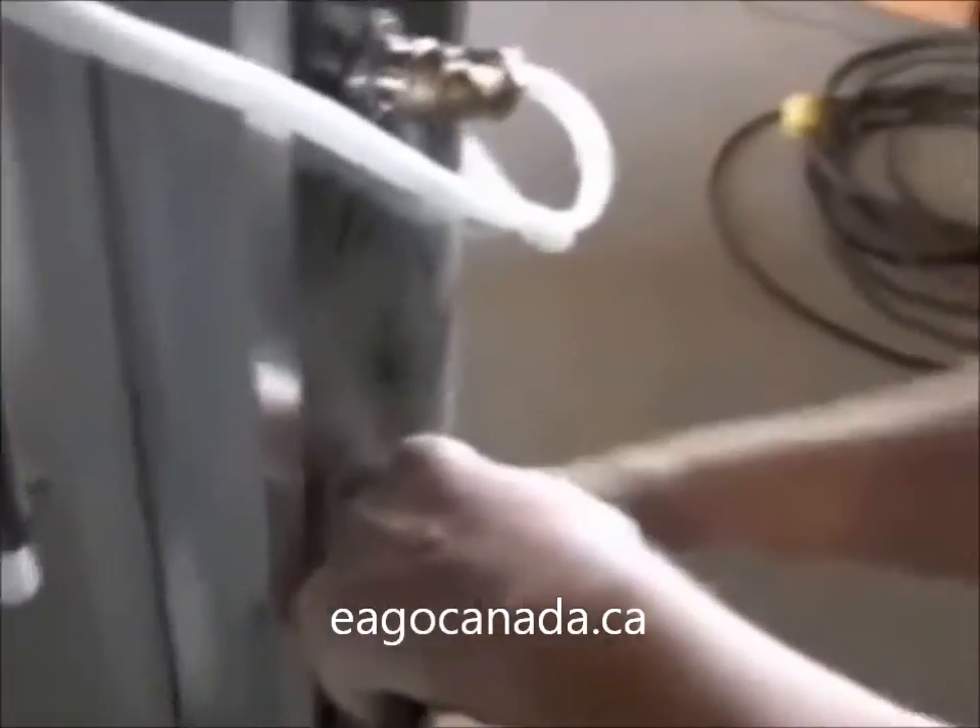You've got two water connections right here coming off. Bottom right is the handheld shower and the top right is the overhead shower. So this bottom one is going to go to the handheld shower — it already has a gasket and it's going to run down to the fitting for the handheld shower. And this one we're going to run up top to the overhead shower.